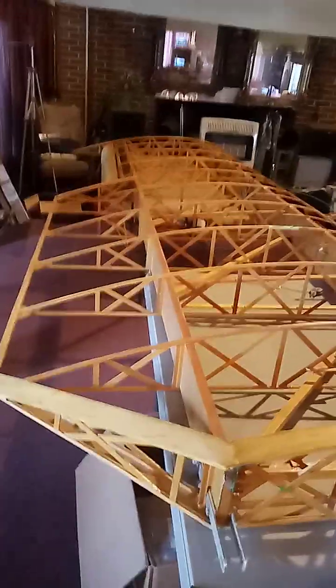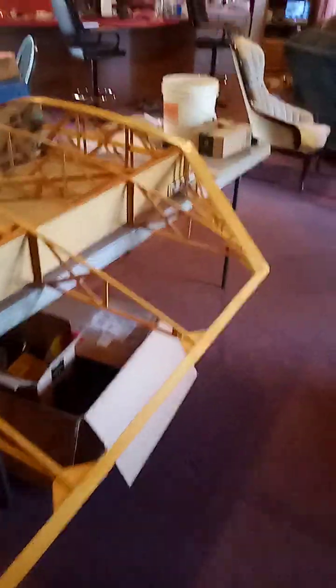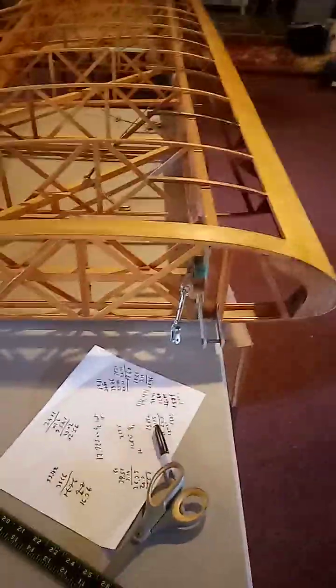I've got the aileron back on here. I'm going to put the aileron on the other wing, pull the fuselage out, put all the old tubes back in, tighten them down, and put this whole plane back together as it was when we got it — to get a bunch of measurements and figure out the angle of the wing in relation to the fuselage. I think it's two degrees or one and a half degrees. We'll also hook up the aileron controls off the stick without adjusting anything to find out what aileron deflection we currently have. That's one reason I like posting stuff — about every 10th comment is something viable that helps.